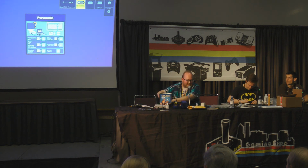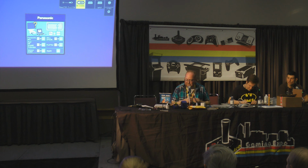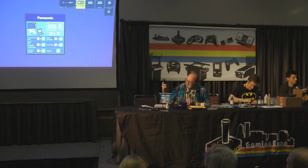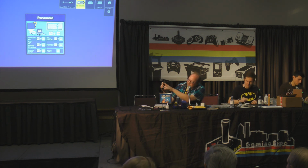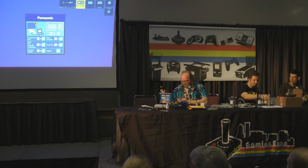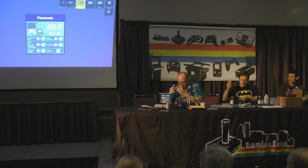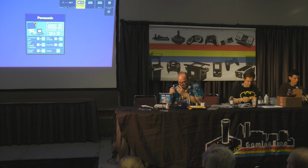Somebody gifted me all these old parts. I try not to destroy any games, but if they're the ones destroying the games, and they gave me this stuff to fix, I'll do it. This is a desoldering iron. I have a soldering iron, desoldering iron. There's a little pinhole thing in there. I put it in there, pull the trigger. The solder melts, gets sucked up into this, and I can dump this out. They don't make these ones anymore, but they have plenty of soldering irons here. So I'm going to just remove the solder from these pins. Hopefully it'll work.